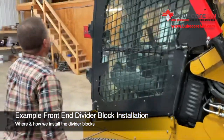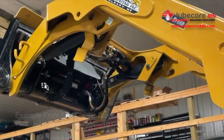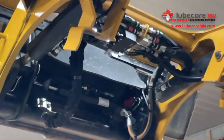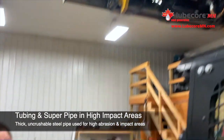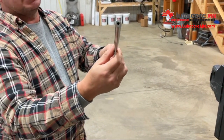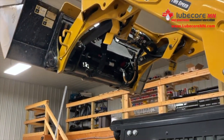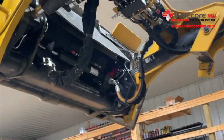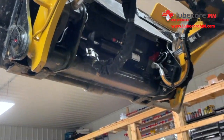If you step over to the front, you can see Nathan's put one of the dividers up here controlling the grease flow to the front end of the machine. How we're doing it is we're protecting the bucket pins — we drilled and tapped through the boss of the weld and we're using this heavy steel pipe. You can see that it's a very heavy wall, very thin inner diameter. We feel this is going to give the best protection to make sure that grease comes out of the sock line and gets down into the bucket. The other points are well hidden and protected, because a skid steer gets into some tight positions and we want to make sure everything stays hidden.